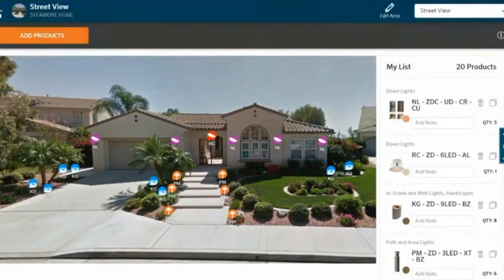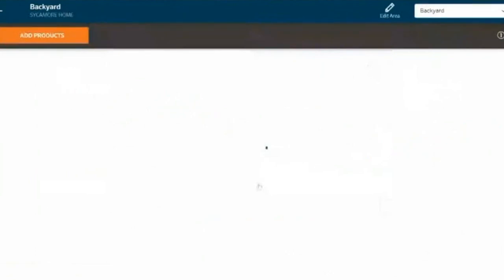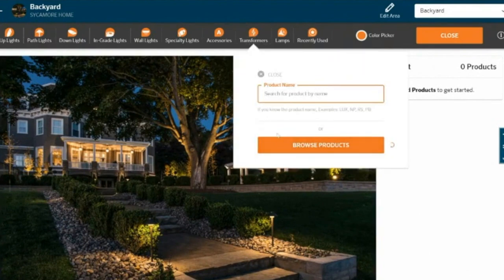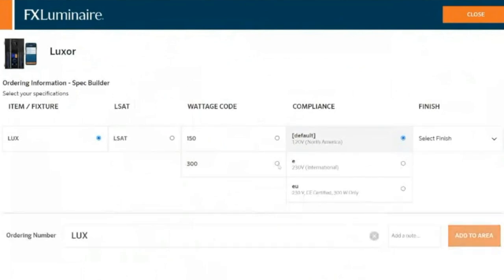I'm going to go back to my other areas. For this backyard portion — maybe the back of the house — I just want to get a few different geographies. I'm planning for power, so let me put on a Luxor in this case because I do have some color-changing things. This is a 300-watt version, North America, so we're using 120 volts. Stainless steel is always a good choice. I know that I have a receptacle down here and one back here, and for the pool house there's probably one on the backside of this wall.